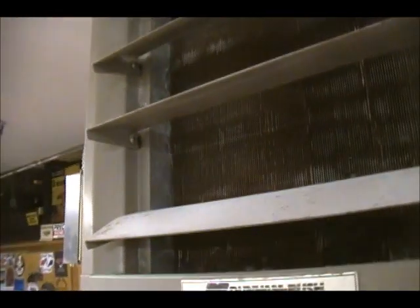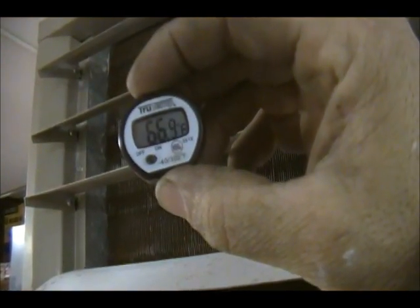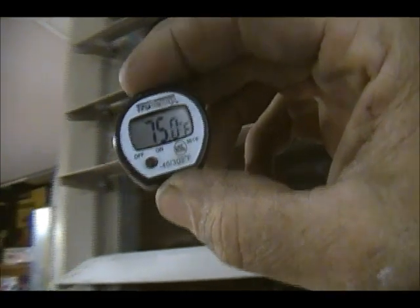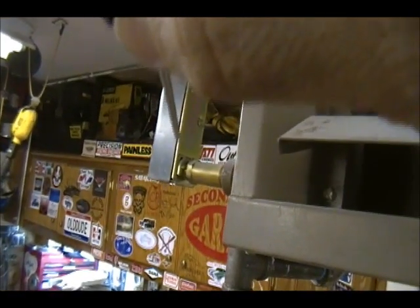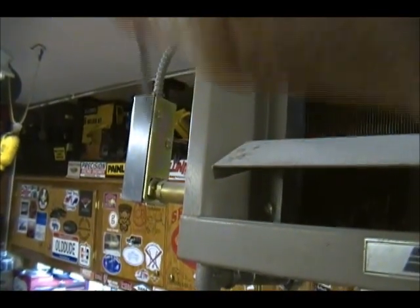I can really feel the heat. I can live with that. The only thing I've got to do is this aquastat. What happens is it shuts off — 120 degrees will kill the fan when it gets up to 120. What I want it to do is let this coil really heat up, and when the water reaches a certain temperature, then kick the fan on. I'm just going to cycle it and see what happens. Then I've got to throw a zone valve on it, and I think we're done.